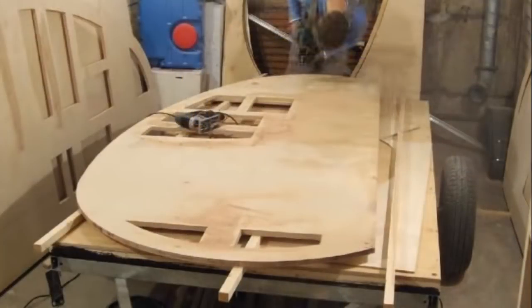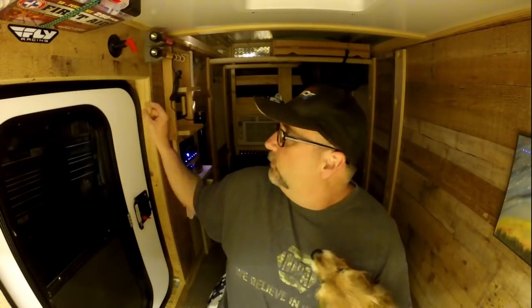Okay, the first one, I would have built this camper with a 1-inch thick wall that I see a lot of teardrop guys using. These doors are designed for the 1-inch thick wall. That's why there's a gap here, which I will trim out eventually. Not only would it accommodate the door better, it would have cut way down on the weight, not having to frame the whole thing out. And then I wouldn't have these seams that you see as I walk around the trailer. It would have eliminated those mistakes that you see in the finish before I coated it and had just a nice solid piece. Knowing what I know now too, I would have sanded the outside much better at those junctions to get rid of those. So I would have gone with the 1-inch walls.